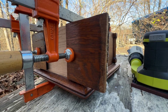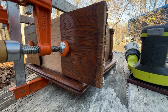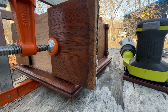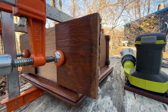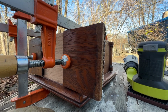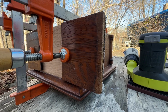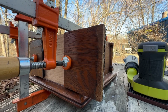That's working fine. No problems there. I modified the governor assembly to use the later model governor, the improved governor, because I had no parts to fix the other one, because that is essentially a motor from an earlier horn machine. That's what they used in these. This is like a late 1911, very early 1912 Victrola 4. They were still using the older style motor that you would find in a Victor 2, for instance, which is probably what they sourced it from.